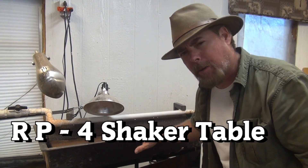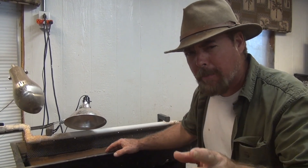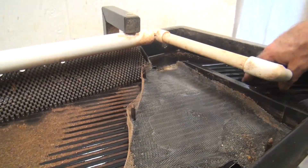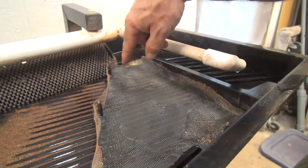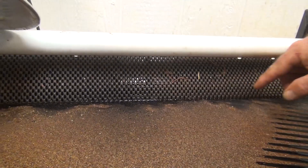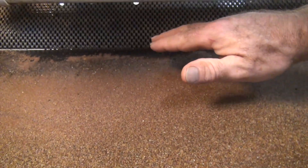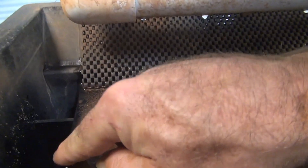This is an RP4 shaker table. They're used in small-scale mining to recover fine gold, especially from lode deposits after it's been crushed to a fine powder. The older models came with a screen; the newer models don't. You feed material in through the top here — it shakes it down. Waters come out of the spray bar, diffused with a diffuser. The lighter material is shaken across until it falls into the trash trough. The heavier material — your black sands and gold — travels across, and most of it goes into your number one and number two port.